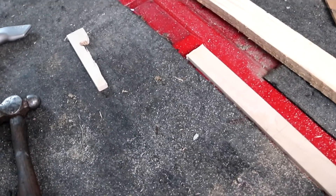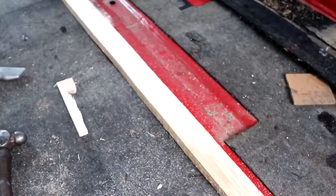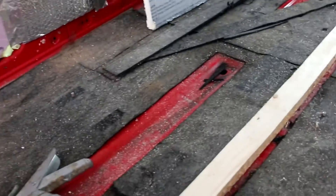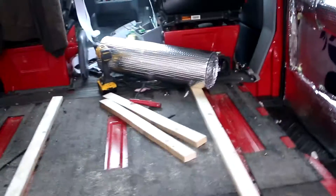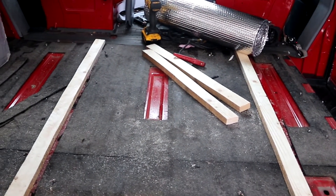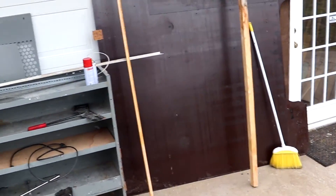I'm going to do the same thing on this side. There's a little spacer in here — here's the board, it'll go right like that. Then there'll be more styrofoam insulation going from here to the wall and between this section and over here on the wall. The subfloor that was in here before — that sheet there — will get pulled out and put back in, and then ultimately flooring would go on top of that.